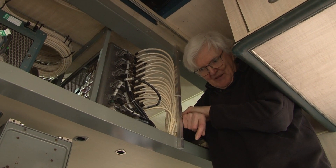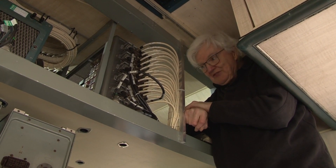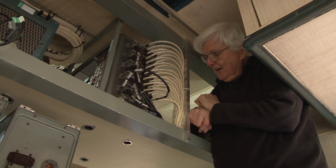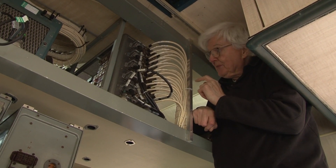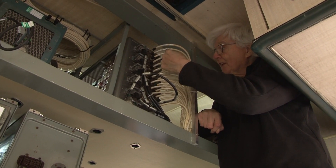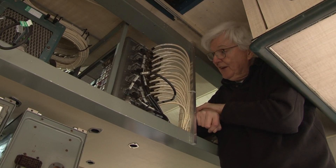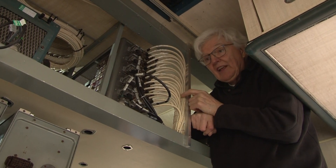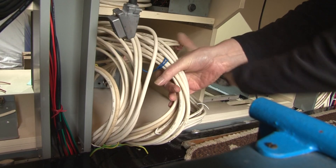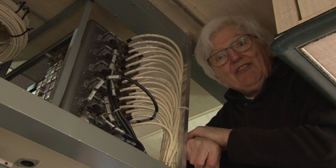Following on from our look at the back of the DA box, I've squeezed into this corner up here to show you the back of the matrix, which, although there aren't as many wires, has fanned out quite nicely to each of the connectors, and the control circuits fan out on that side. It's very difficult to get this PSF1-2, which is stiff and awkward, lying nicely — it has its way of doing it, and it's a bit of a fight.